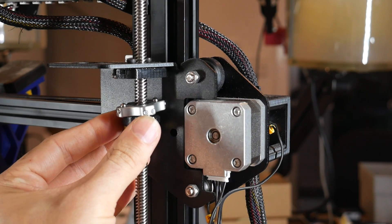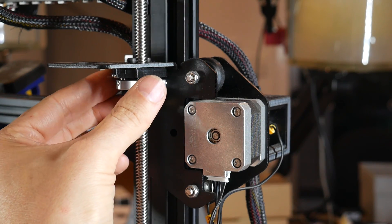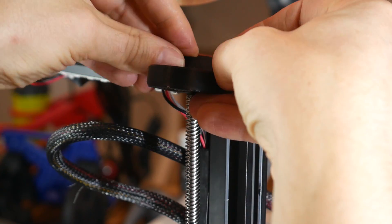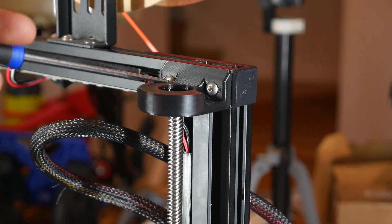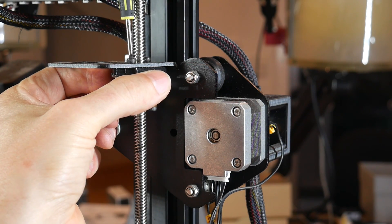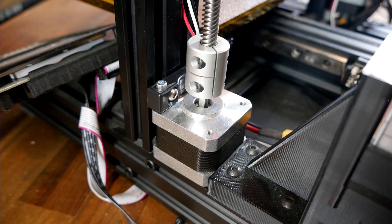I found it easiest to pull out the lead screw, pre-assemble Wobble X on the shaft, and then rotate the lead screw to lift the assembly up to meet the gantry. At this stage, I hadn't fully tightened the M3 bolts because I was still yet to install the required lead screw bearing support at the top. For the Ender 3, I had to turn this upside down to reach. After this had been tightened, everything was sitting in a natural position, so I tightened the rest of the bolts. For the record, I used a rigid coupler with a plain stepper mount at the base.